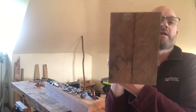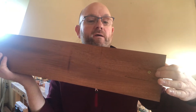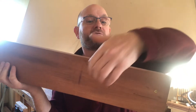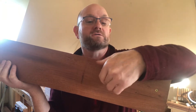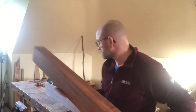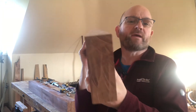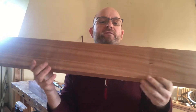This is two pieces of mahogany which I have temporarily screwed together so I can align the three pieces up and do the through holes for the hardware that I'm going to be using. Then we have the third part, which is a lovely piece of figured wood — there's a lovely figure on top which I'll be keeping for the face of the vise.